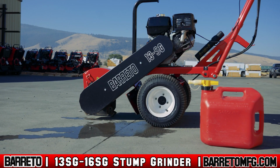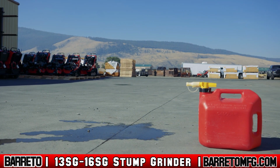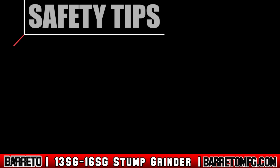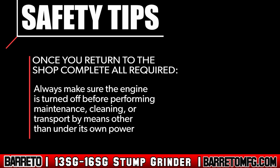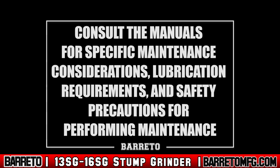If fuel is spilled, never attempt to start the engine. Move the machine away from the spillage through other means before you start. Never refuel indoors or near a source of flames or sparks. Always do the necessary lubrication and maintenance required once you get back to the shop, or if necessary, in the field. Always make sure the engine is turned off before performing maintenance, cleaning, or transport by means other than under its own power. Consult the manuals for specific maintenance considerations, lubrication requirements, and safety precautions for performing maintenance.